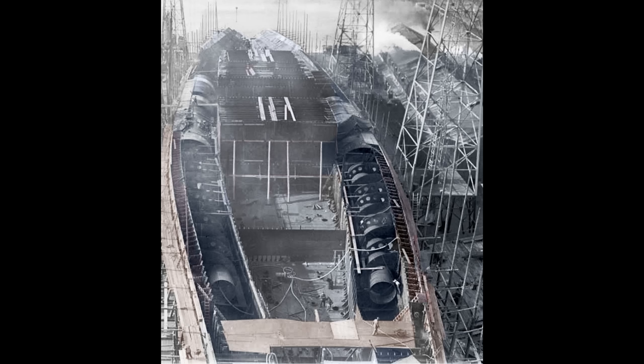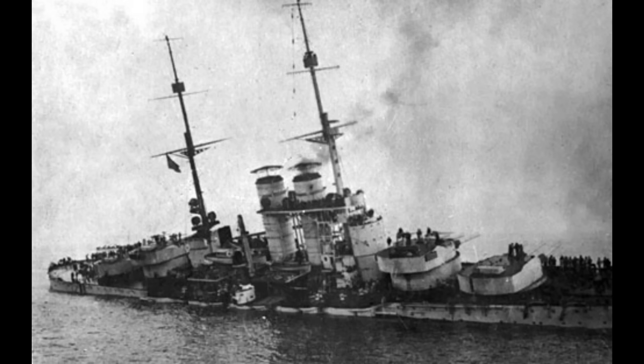That brings us to another factor: the torpedo defense system. We won't discuss how it protects against torpedo attack — that's more suited to the protective side of vessels — but the torpedo defense system will take up hull volume, and how that volume is arranged is a major factor in the ship's architecture. You could mount it externally in the form of bulges, which maintains more internal volume for interesting things inside, but increases your overall cross-sectional area which slows you down. Alternatively, you could have your torpedo defense system built entirely into your hull layout, maintaining a sleeker approach and higher speed, but it then takes up internal volume that would otherwise be used for machinery, shell rooms, magazines, and crew. If your torpedo defense system is too small, your entire ship might end up on the bottom — at which point all your other nice design choices won't matter.